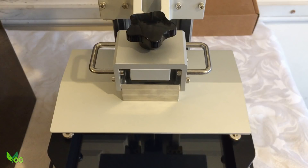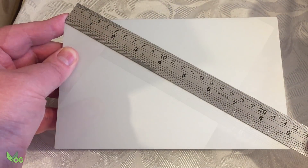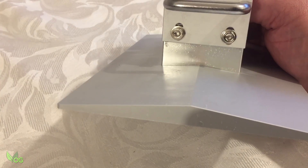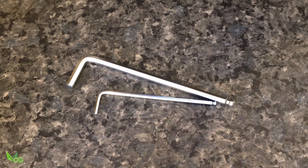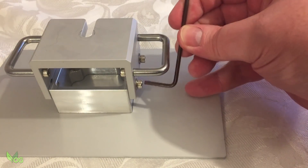With the lift-off lid removed, the printer's metallic goodies are on display. With this printer it's important that you don't fiddle with the knob too much as it might fall off — it's not attached to the build plate and remains in situ, so you'll need to grab the handles instead. It's a nice solid metal plate, big and meaty but contoured to help shed the resin drips. I do like these handles, but they present a problem: I'm not keen on these small hex bolts. Both the Mono X and the Saturn use larger bolts with a chunkier key, and that feels better. This smaller hex key is fiddly and, because of these handles, reach isn't ideal. Shorter handles or a bigger key would fix this issue.